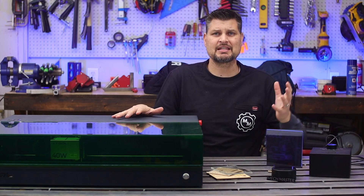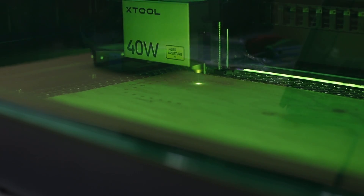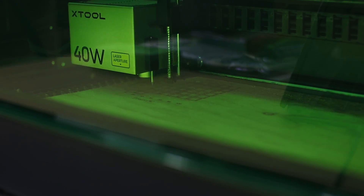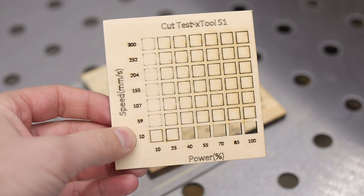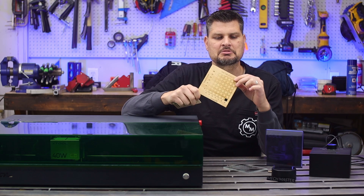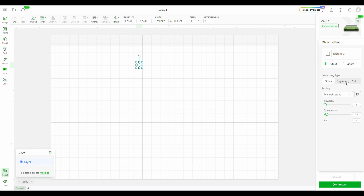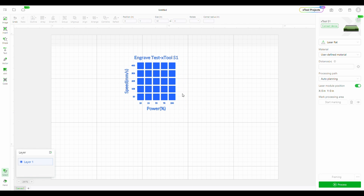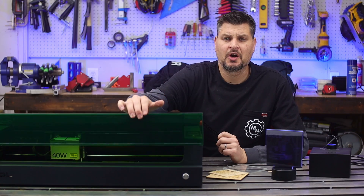The S1 has been out less than six months — it's very new. One downside is there aren't a lot of people who've done the guesswork for you yet, so the community settings list for materials is a little minimal. They still have a decent selection list online, but you'll want to run a sample piece for every type of thickness and material you use — acrylic, wood, and so on. I've even cut through three-eighths plywood in a single pass. Within Creative Studio, doing material test pieces is a breeze — just select your shape, whether you want to cut, score, or engrave, pick your settings, and that's it.